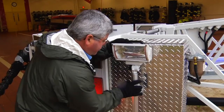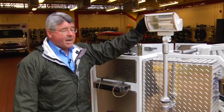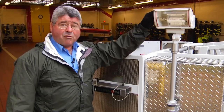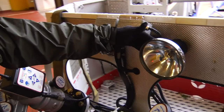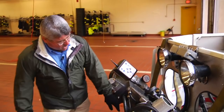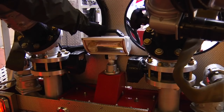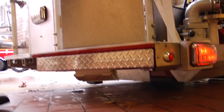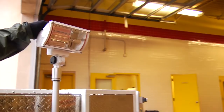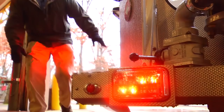The platform includes lighting on telescoping poles at the back of the platform, with several available lamp head options — quartz and LED, both 120 and 12 volts, also 240 volts. There are 12-volt spotlights on the front of the platform with several options for different intensities and types. There's another 120-volt powered quartz light on the front that could be changed to an LED fixture. There are additional quartz lights for scene lighting on the underside of the platform, and another telescoping quartz light at the back — these can also be converted to LED fixtures. Warning lights on both sides and front of the platform illuminate it in low light, smoky, or foggy conditions.